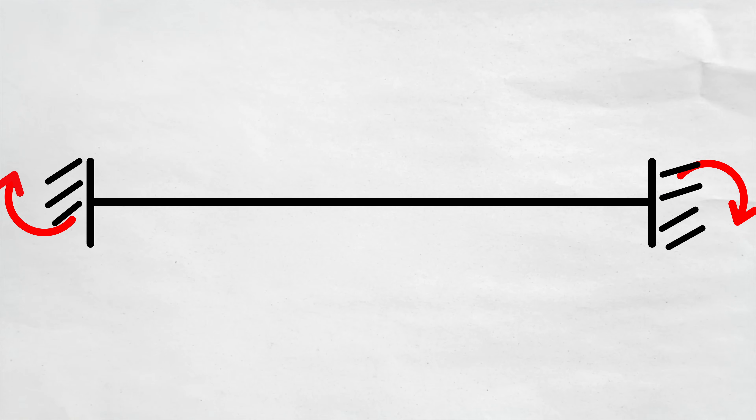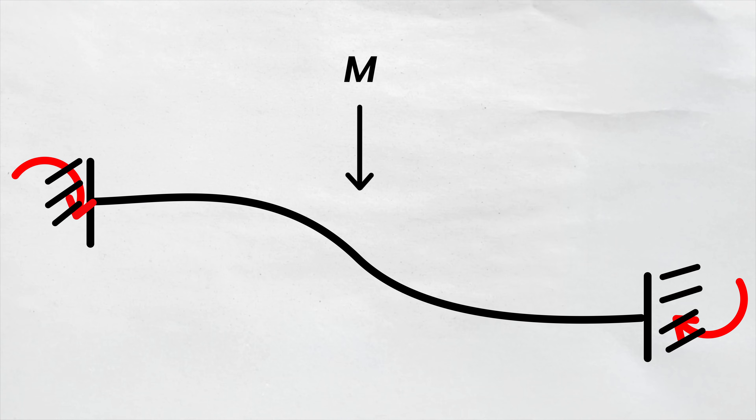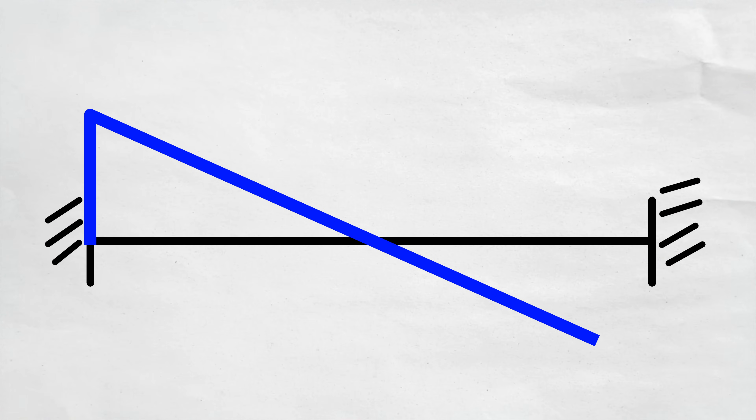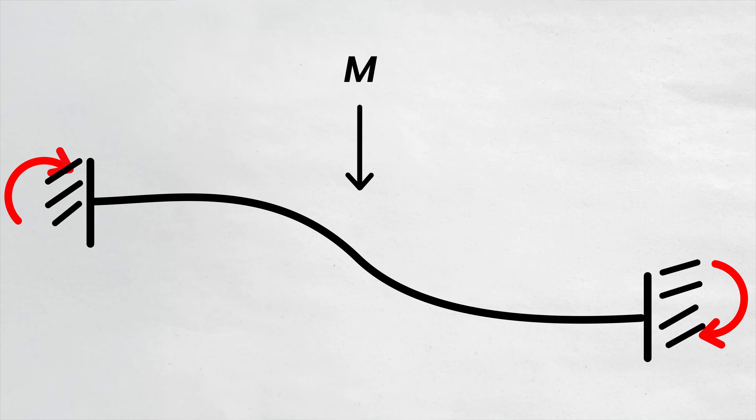This is actually stiffer — the movement while moving vertically is not actually rotating, it's keeping vertical. So you see your plates are forming an S-shape effectively. That means the moment on the left needs to sum up to the total moment. Whatever moment you're reducing on one side, you reduce the moment on the other side, potentially leading to an increase in force transfer from left to right. When we back-calculate, we can see peak moments on both left and right sides, which are almost equally balanced. Looking at a two-fixed-support system — typically PL/8 — you can see significantly reduced bending moment demand. So instead of just P times L, you've got P times L divided by 2 when you rework the formulas.